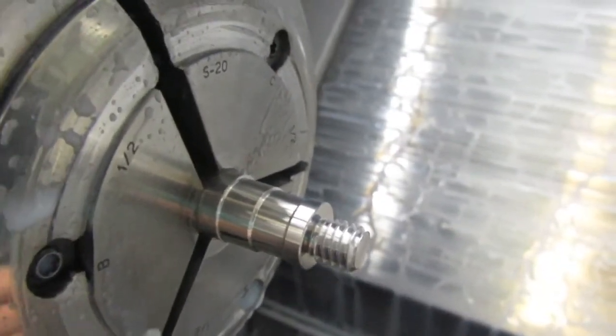This is one of our old CNC machines. Now it's going to deburr real quick - well, there's no real deburr process. It's going to clean up the end of the thread and the front of the thread with little chamfers, and then it's going to re-thread it to make sure it didn't roll over any burrs in there. Probably about five passes but pretty quick. Now I'm going to rerun it without coolant just so you can see what's going on.